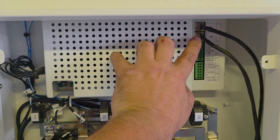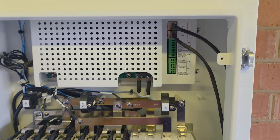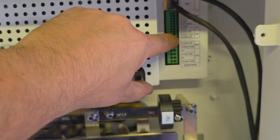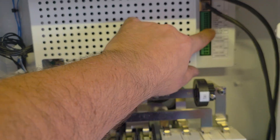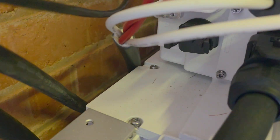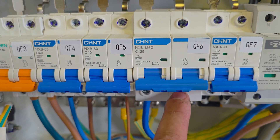In the gateway we have our two comms cables up here — this is FE1 and FE2. One is going to our stack and one is going to the EV charger. We've got connectivity to the internet into the stack so that will provide comms to all the other devices through the connection here. You can also use all these ports for remote signalling of buzzers and lights to alert people when you're going off grid, or for RS485 comms. In the gateway we've got our grid feed coming in, bringing power from our metering area, and then we've got the return via the backup port going out to the consumer unit.